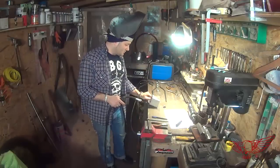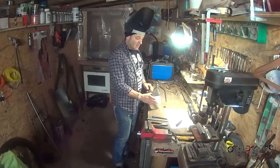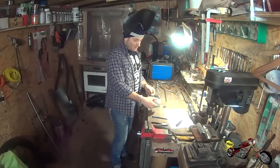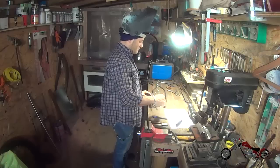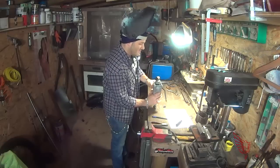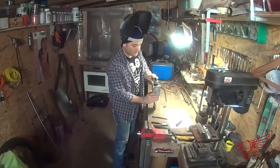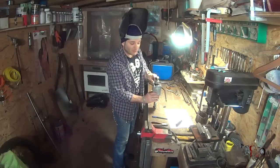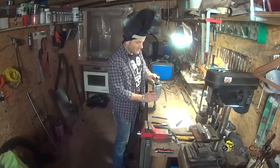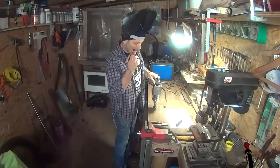The box is welded now. Although it's not the prettiest weld, we don't really care because it's not an object anyone will ever see, but the box is now one single piece. We have to proceed with bending these two pieces to wrap around so that they will allow for the shock absorber to go inside and be held in place while the upper screw compresses it. These need to be really good welds, so we're going to use these thicker pieces and the stick welder, which has more power than the MIG welder for thicker materials. Let's proceed with bending these two rods.